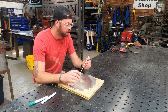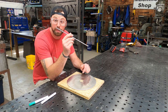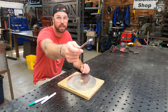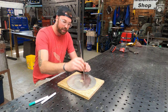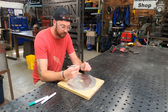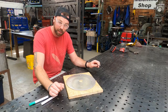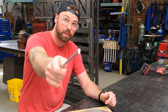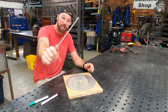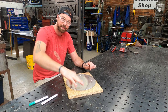I've waited like 4 days, 5 days for this to be shipped from Amazon. This is a 12 inch piece of quarter inch stainless round bar. And this is what's gonna be used to make the handles for the press plate. So I'm gonna mark on here some symmetry lines, then TIG weld them on. Oh, but I heat and bend this obviously into loops if that wasn't already clear. I'm gonna take this and make two horseshoes out of it that I can weld on like that.